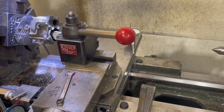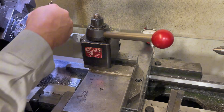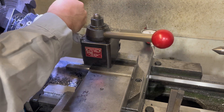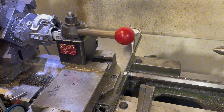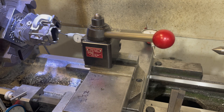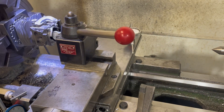What we're going to do is run up and down the cylinder wall right next to the exhaust port, and you can see how that tells us what we need to do. I find this to be a lot faster than trying to circle it and get the indicator circle up and down. Just a tiny bit more — that's good on that side.